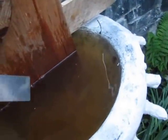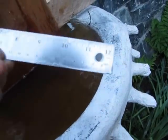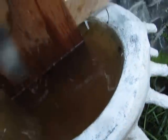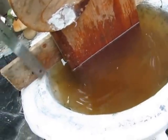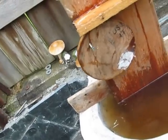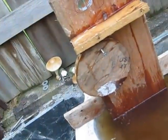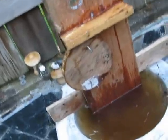When it is in the pond, the submergence here is just 10 or 11cm — not much of a submergence. And it is pumping about 32 high, so that is 3 to 1. If I do it in the pond, I will have about 30cm of submergence, so it will pump a lot quicker.